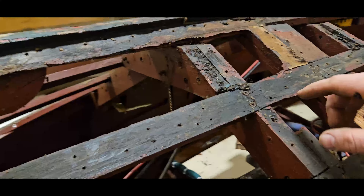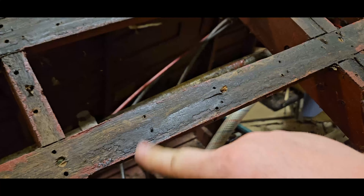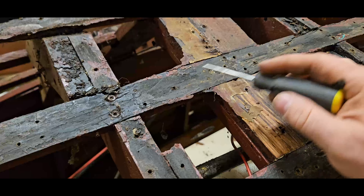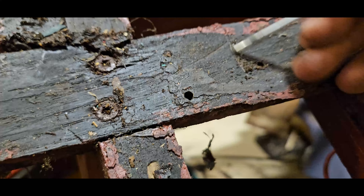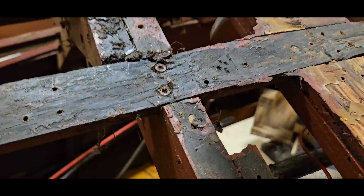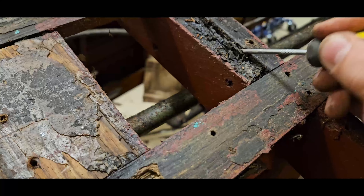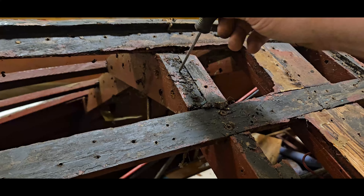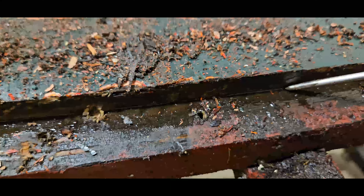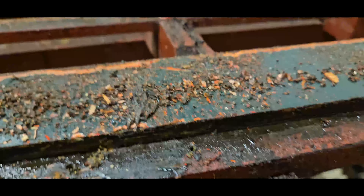As I mentioned in the last video, there's quite a bit of oil on a lot of this wood, and you can see how that's really soaked into the wood in a number of places. I'm going to take an awl and show you what the wood looks like after it's been oil-saturated for quite some time. This part here — you can see it's mostly on the surface but it did penetrate down into the wood. It's not particularly dry rot, but it is soaked with oil, and that will lead to more severe dry rotting over time. We're also concerned it may have affected the actual keel.